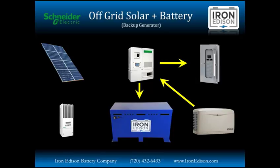In this case, what we will see is the generator will fire up, run for just a couple of hours at maximum efficiency. It will charge the battery while simultaneously powering the loads. If a situation arises where the amount of energy demanded by the loads exceeds the amount going to the charger, the inverter will automatically reroute the power to the loads. We'd rather keep your lights on and your appliances running. We can save battery charging for a little bit later time. So all of this is happening internal to the inverter and happens seamlessly.